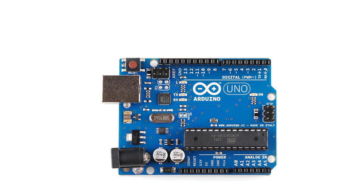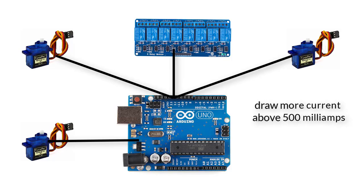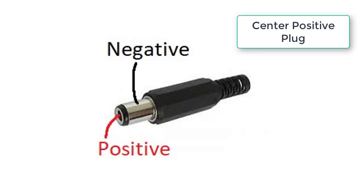The components on the Arduino Uno itself will use around 25 milliamps of current. If you attach more components such as relays and motors, then you'll be drawing more current than what the regulator is rated for, which means you'll burn up the part. So while powering the Arduino, keep in mind the 1 amp limit of the voltage regulator.